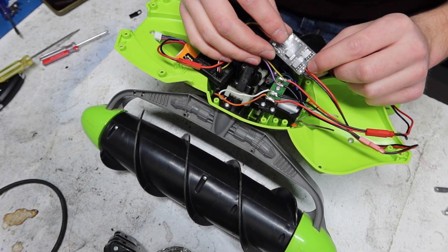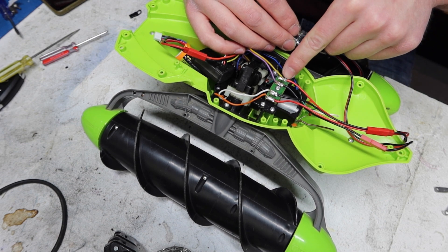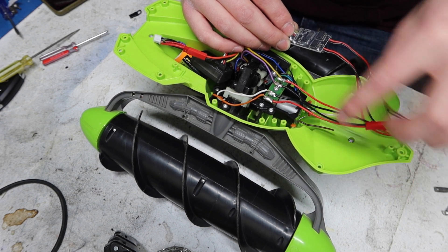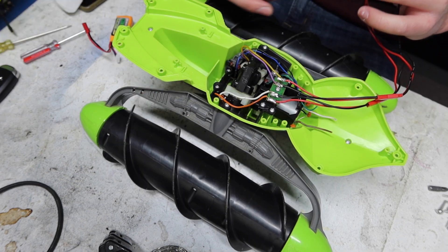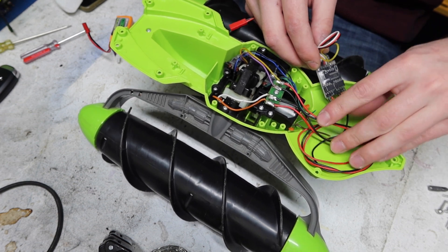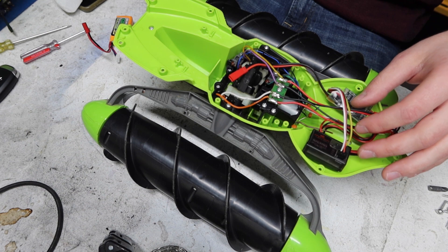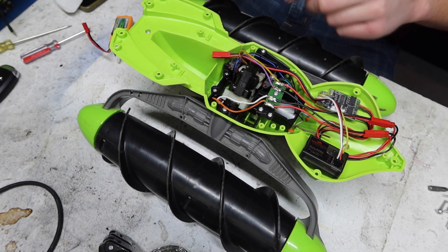After a little trial and error, I discovered that the markings on the dual ESC do correspond correctly to the markings on the motor circuit board — M2 to M2 and M1 to M1 — and the polarity is correct as marked. Now that the controls are taken care of, I need to figure out how to package everything. I'm going to coil up the wires in the front area, which will also house the speed controller and receiver, with the battery cable going back into the rear cavity.